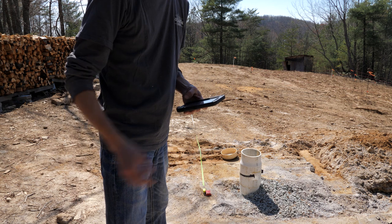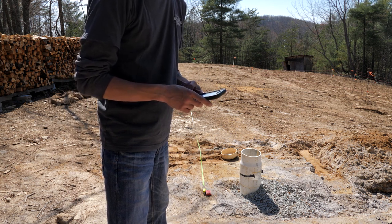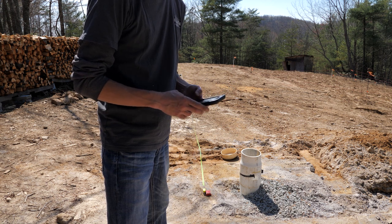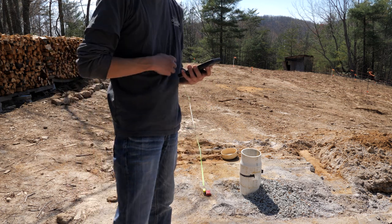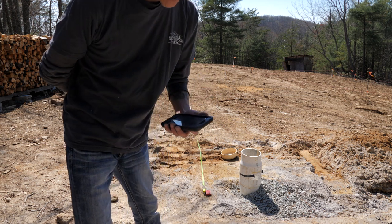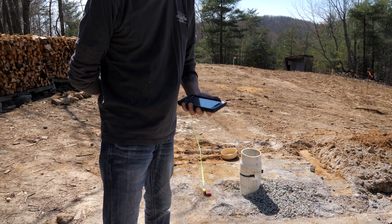So if we set the pump at 440 minus 332, it's 108 feet times 1.47. That's 159 gallons of water above the pump. At 5 gallons a minute, that would run out in 31 minutes full bore. I can live with that.